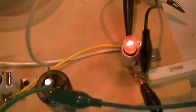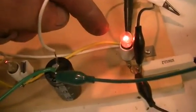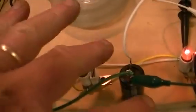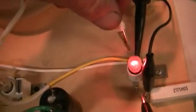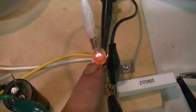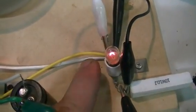That is the brightness of the globe. What I'm going to do now is hook this cap up at the back of the globe so we can still measure the voltage across the globe and the current flowing through the globe. That is all we're going to do. This cap will store energy and give it to the system when the transistor switch is on. So what does that bulb do when I hook the cap up? You can see it dulled right off. That is telling us, being an incandescent bulb, that we now have less current flowing through it, which will result in a lower voltage across it.